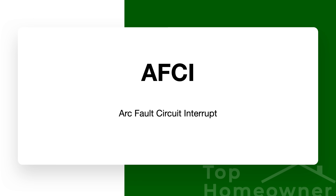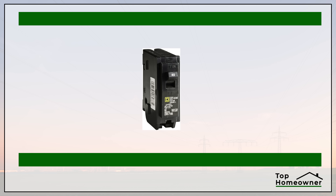Now let's throw AFCI into the mix. AFCI stands for Arc Fault Circuit Interrupt, and these are designed to detect and respond to sudden spikes of power. This is different than a standard breaker because a standard breaker looks for a buildup of heat — when it sees too much heat from too much current flowing through, it trips. Sudden spikes don't always set off a standard breaker, which is why you need AFCI in addition to everything else.